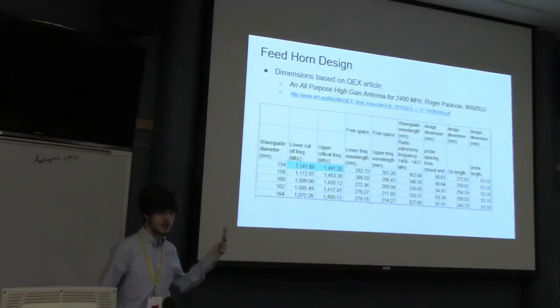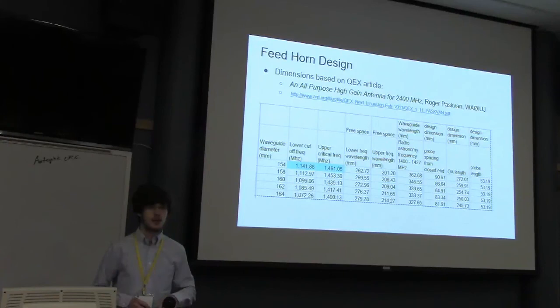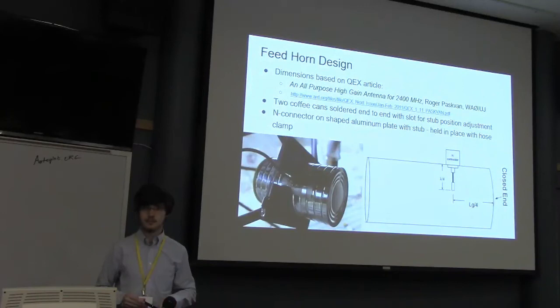Now, you mentioned a network analyzer you use for your testing. Do you have the capability of measuring reflection on that network analyzer? It's an HP 8410. Okay, I love those things. Did you look at the VSWR? Absolutely, that's how it was tuned. Very good. What did you achieve? What he didn't mention is that the can had a metal plate on it with two hose clamps. That makes it adjustable for the spacing, and then the length of the thing was set there with your clippers. Very good.